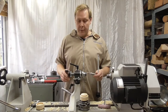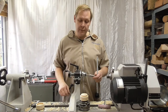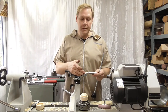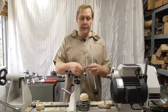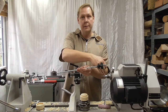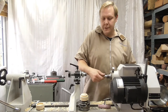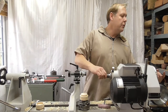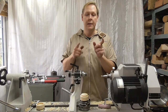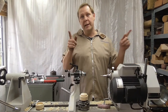What I'm going to do now is show the hinge plate in operation. I've made another male thread — we'll show the cutting of it and the advantage of having the hinge plate. I'm also going to show the morse taper cutter holder — it's a stainless steel two morse taper. We'll insert it with a draw bar, which is really important because we don't want it to vibrate loose. Make sure you don't have too much threaded bar sticking out the end — a maximum of three inches. If it's any longer, as it's spinning it can start to whip and bend the threaded rod, so you might have to cut it down to length.